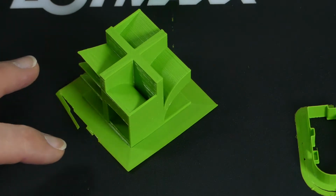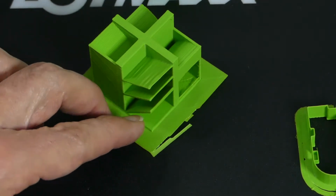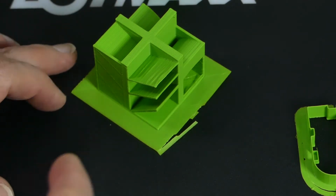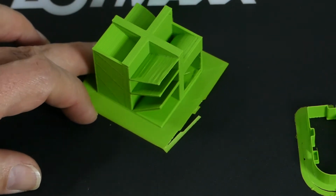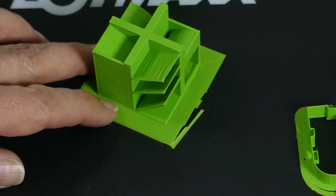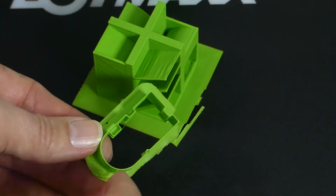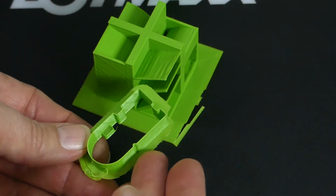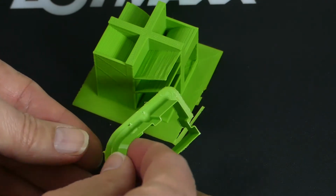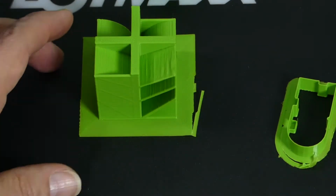And it took me a while to get all of this set up, because the different blocks are also done with different slicers, and each slicer then shows what the pros and cons are, because some slicers, for example, won't do something like this because it's not a solid object. They would just tell you it's non-manifold and refuse to print.